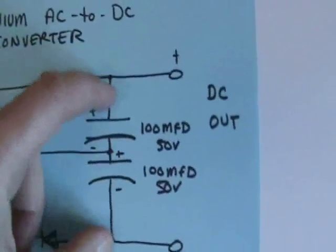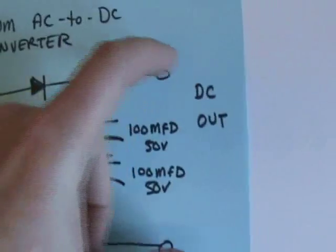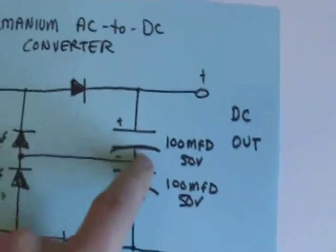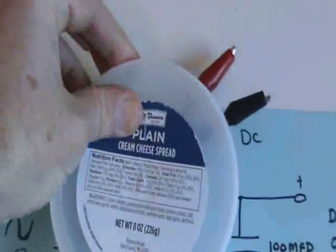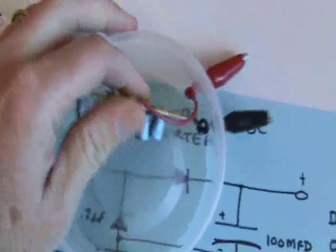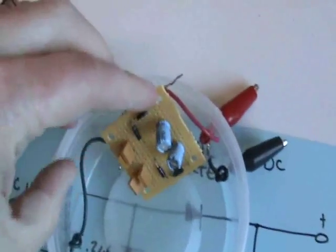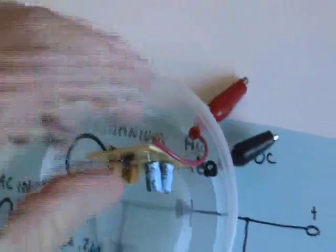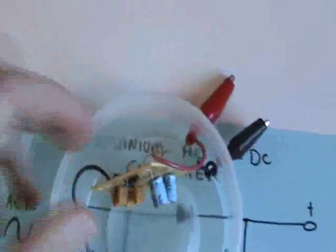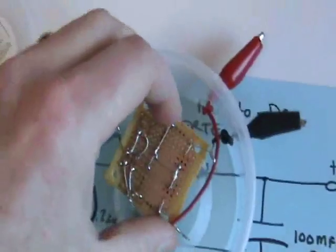You don't want these to build up to a voltage beyond their capacity — these are electrolytic. I finally took the time to breadboard this thing; it's in a little cream cheese container. The advantage to breadboarding it is there's less resistance. When you use clip leads to hook everything up and prototype boards, there's a lot of resistance. So breadboarding is a little bit cleaner.